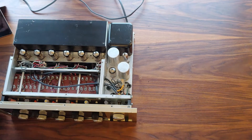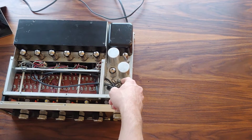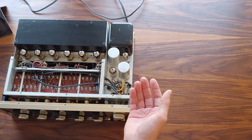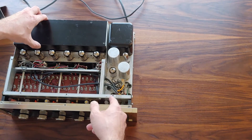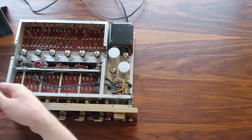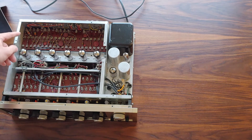You can get into it — you can see this is just ugly. Looks like a number of these were replaced. These are supposed to be green and they're black. It follows an EIA color code — those would be green on two halves of the pot or the wiper in, one side of the pot would be green and the other side would be brown. Back here you can see it's all original — original caps, original resistors.